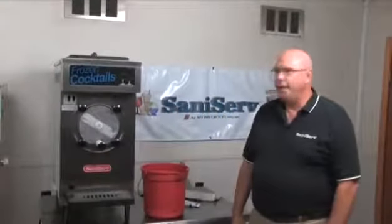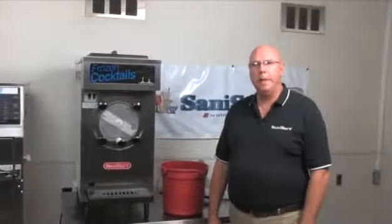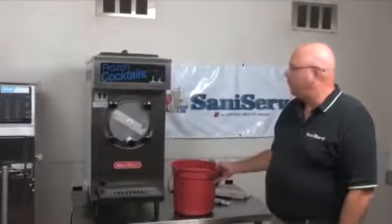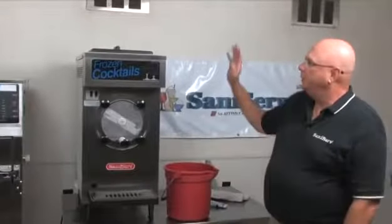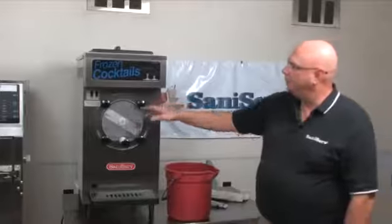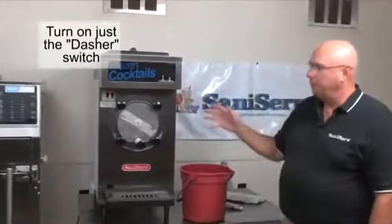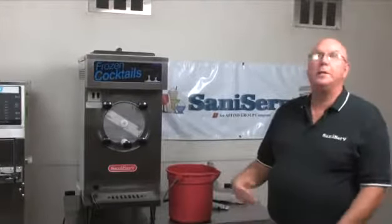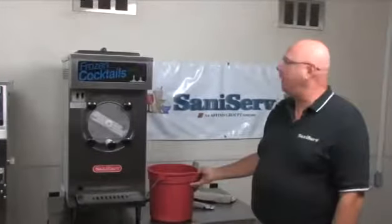Okay, it's the end of the day. We have dispensed all of the product we can get out into clean, sanitized buckets, put them back into the walk-in. After that, I ran 2 gallons of lukewarm water with a little bit of detergent in it through, with the freezer off, of course, just the dasher on. Let it rinse, emptied that out into a bucket, and then did it again. So I'm at the stage now where I'm going to start taking things apart to clean.